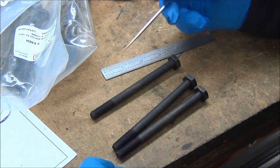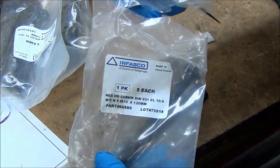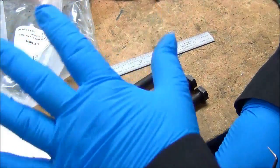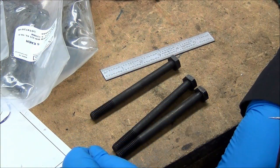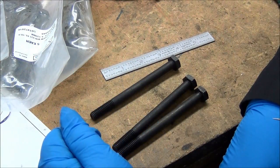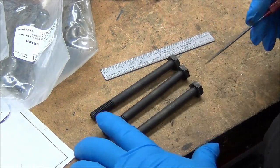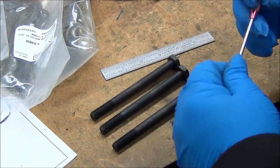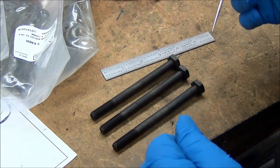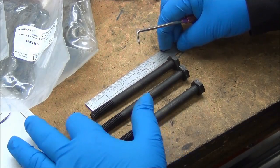I'm going to do a little test for the CNC lathe. These are hardened bolts — they're 10.9 metric, equivalent to SAE grade 8. I got them with the wrong pitch, so they're kind of worthless as fasteners, but I'm going to use them for testing. This will give me a good idea how the machine handles hardened bolts. I've cut several before, but that was before the machine was running better.